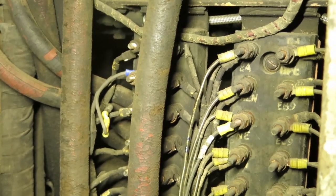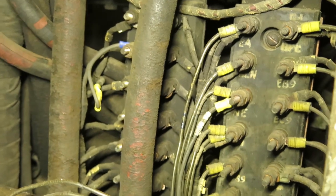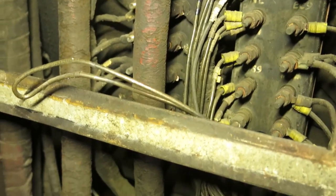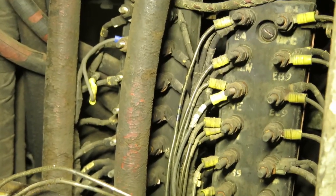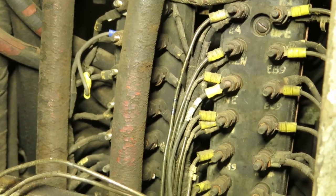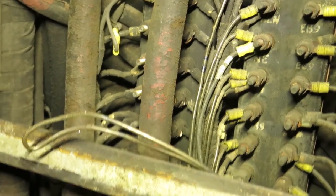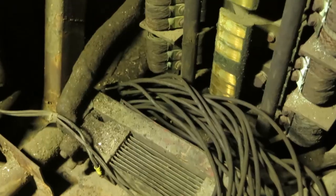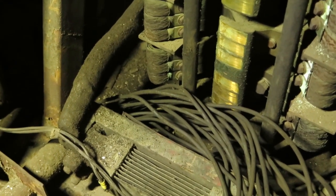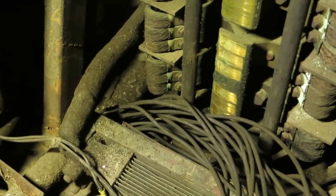So here's that terminal board on the back of the electrical cabinet. It's the one on the left. And so what I did, with the help of Nick, one of our regular volunteers, is tugged and pulled and made sure each wire was correct and then disconnected them from the terminal board. Fairly straightforward process. So now that they're all disconnected, I'll just cut all these loose ends off and pull it back through the conduit just to make things tidy. So that will be the next process.